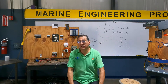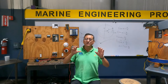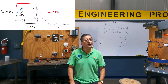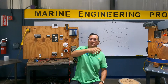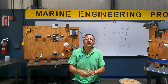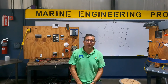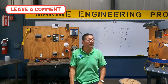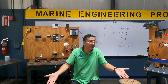The lithium batteries are 48 volts — that's the battery bank. In the output of that 48 volts, the system has one DC-to-DC converter. The DC passes from 48 to 12, and I feed my panel from the output of that DC-to-DC converter. It's very common that people say they don't have power in their DC panel. Traditionally you say, go to the house battery bank and verify the voltage.